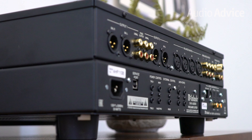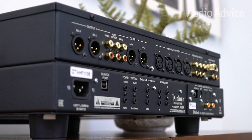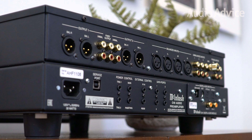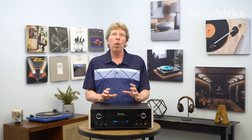The tone and balance control circuitry was as good as advertised. You'll be able to adjust bass, treble, and balance, or if you wish, completely disable those circuits for a pure signal path. For handling all 13 inputs, McIntosh gives you the ability to name each one to your personal taste and also trim the input volume up and down on every one, so when you switch from source to source they can all be at the same volume level. The signal switching all takes place right at the connectors through a special control circuit. The C49 also uses McIntosh's best volume control design — an optoelectric circuit that allows fine-tuning of the volume with no signal passing through the volume knob, assuring years of noise-free service.